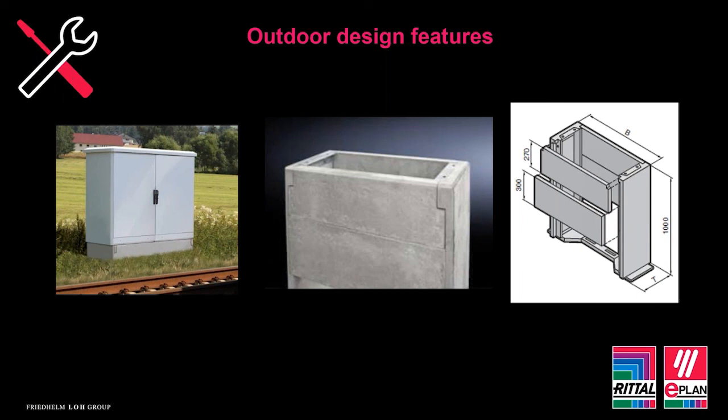So a hole where the enclosure needs to be sitting is dug. The pieces of the plinth are assembled, as this comes flat packed, like the image you can see here on the far right. Cables come in via the opening near the base and up through the plinth. The dirt and rubble that was initially dug out are then used to backfill the plinth, holding it in place, and then the enclosure is simply screwed down to it using the predefined holes.